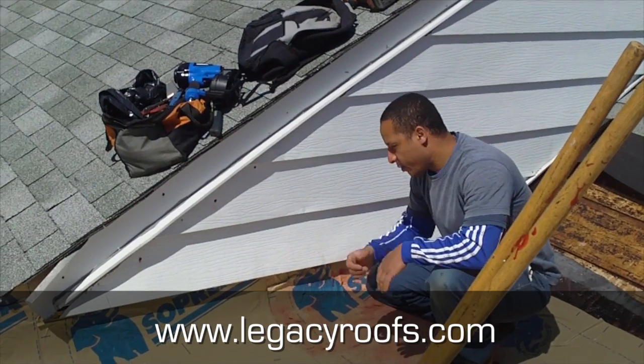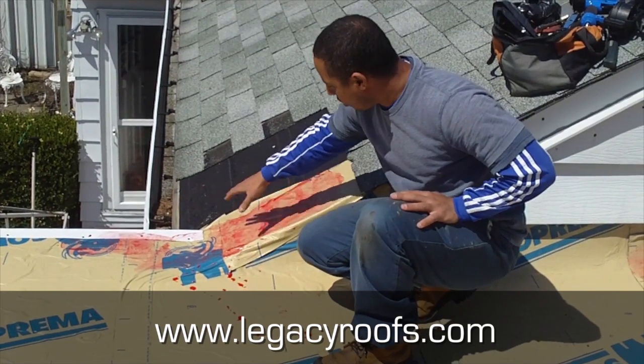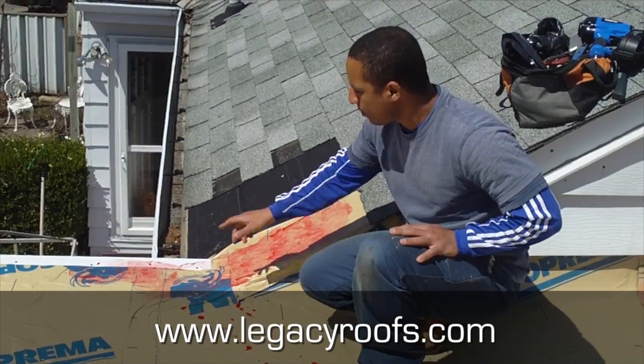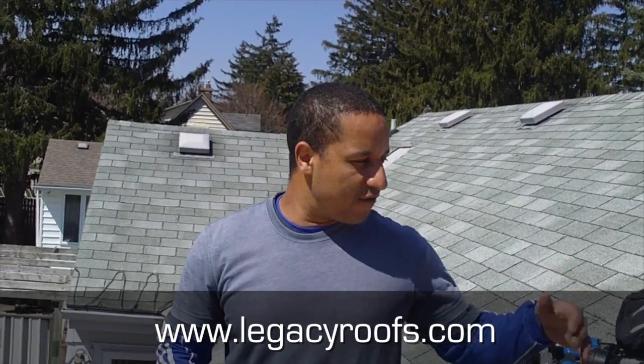We brought our base sheet up behind the metal siding and now we can roof that in. We've closed this area nicely — remember, you could put your hand in there, it was all open and exposed. We added a new drip flashing. The eavestrough was in good condition so there was no reason to expand the project. He's pretty much watertight now — we're going to put a cap sheet, finish doing the shingles, and show you the finished product.